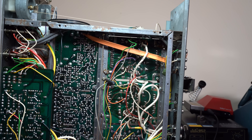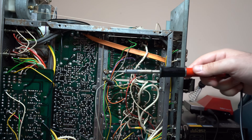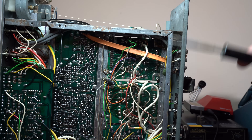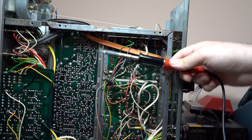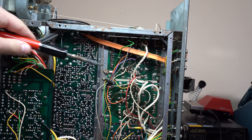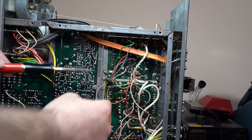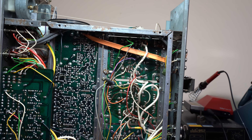On the bottom side there are signs of even more bad craftsmanship. Somebody burned all the wires while presumably changing one of these hybrids, which is really easy to avoid. Remember that when the soldering iron is hot, not only the tip is hot but also this area, so you want to avoid anything plastic near it — which is exactly what this person failed to do. The solution is easy: just approach the solder joints from an angle where nothing is in the way and stay clear of any wires on the chassis.